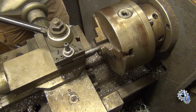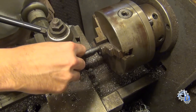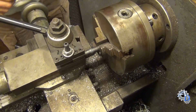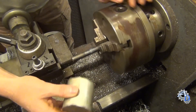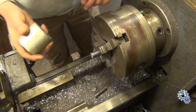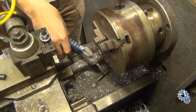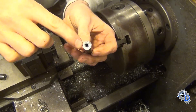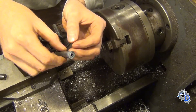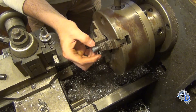I was able to put more pressure on it this way than using the drill chuck — it's more stable. Let's loosen this up. Yeah, that got really hot really quick. It's not moving... now it finally came off. Let's try that again. You can see where it actually melted and pushed into the interior. The one thing I didn't do is after I welded it, I didn't put more pressure after it stopped to help fuse it together.